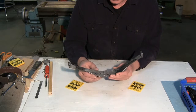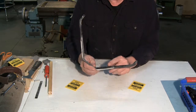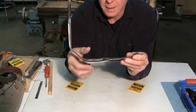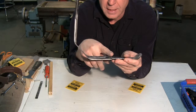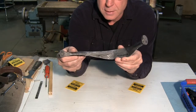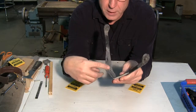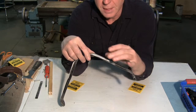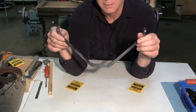From here on, all I'm really doing is dressing it up a little bit, and also lightening it. When I laid the unidirectional carbon fiber in here yesterday, we got kind of thick — you can see it's kind of thick right in here, and that's not structurally necessary. We need the carbon fiber to tie into this leg, but this leg is actually plenty strong enough — stiffer than it'll ever need to be. So what I'm going to do is carefully hand-sand a bunch of this material out and taper it into the leg. I've already done it on this side so you can see how that looks — all sanded smooth and tapered in. Then I'll be putting some more foam in this area here and a little more foam here, and sanding this into the shape of the fairing like on the full-size airplane. A little shaping, a little sanding, a little dress-up, and it'll be ready to install on the airplane.